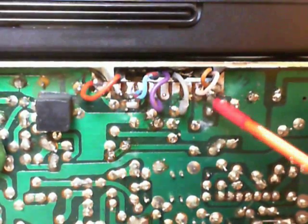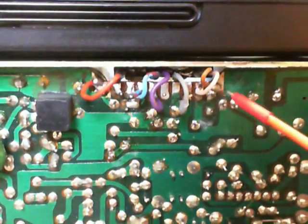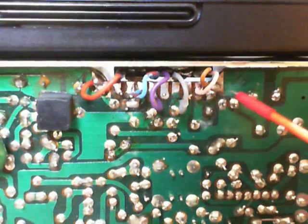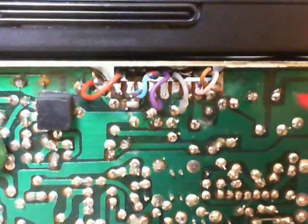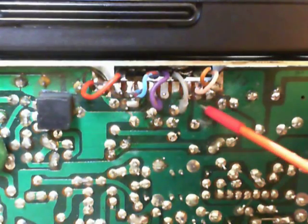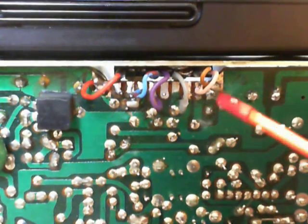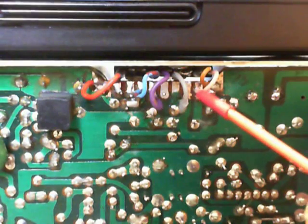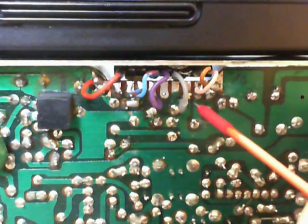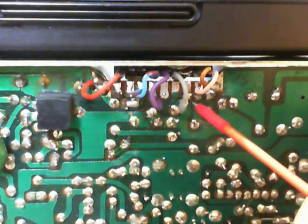You can see here pin number 9 and number 10 are latched over and crossed over. Pin number 10 is the output to the modulation transformer, and pin number 9 is the bootstrap. Pin 7 and 8 are soldered together and go to pin number 8, to the ground.